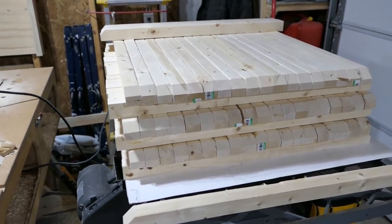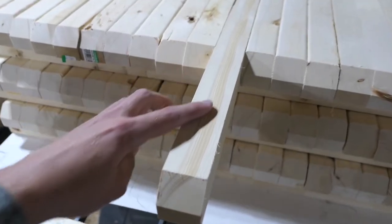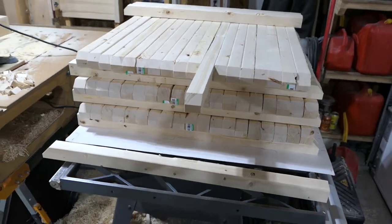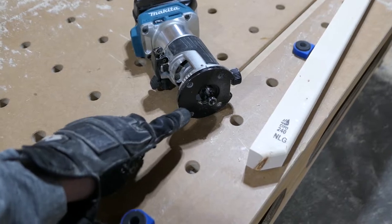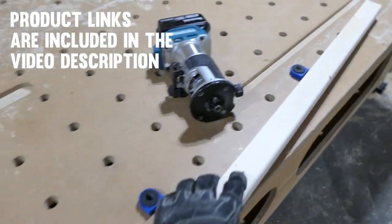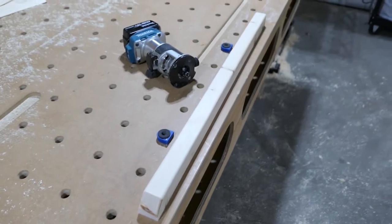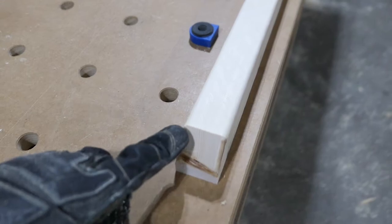And now my neighbors hate me. But wait, there's more. The sides of some of the 2x4s are in really rough shape so I'm going to have to route those that I trimmed on the top. Knowing myself, I'm probably going to end up routing all of them. I have my router set up with the round-over bit. On my workbench I have two bench dogs and I can use them to push the piece against when I'm routing. I'm routing the outside of every post — these two long sides along with the two little edges.